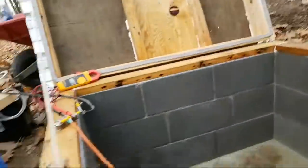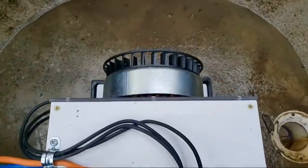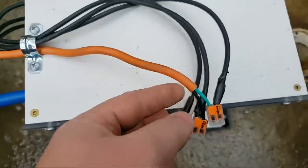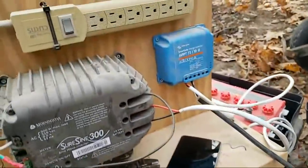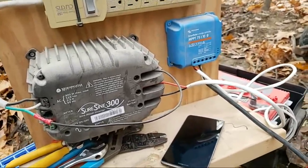Let me see if I can get down in here — I'll just go handheld. Okay, in there we have a Pelton runner. This runner is the one that Spencer Langston of Langston Alternative Power gave me, and I have a Mott Energy rotor on the back — an alternator/generator thing. This is a three-phase permanent magnet AC generator, and those are three wires I'm running to an extension cord going to a rectifier. The first thing we have to do is verify that the voltage isn't so high that it's going to fry the charge controller. We've been having trouble getting the Bluetooth connected on that, so we may not get any power readings today.